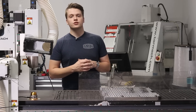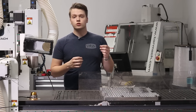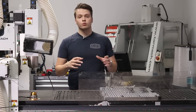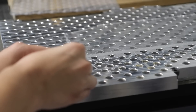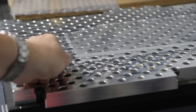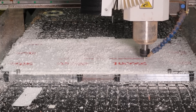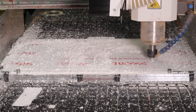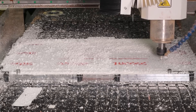It's taken me a little while to get used to this vacuum table, but there are a few tips and tricks that will really help you succeed. The first one is always use downcut tooling whenever possible. Lateral forces aren't an issue, but vertical forces are — if you push a part from the side it's very hard to move, but barely lifting a corner with your fingernail will break the vacuum immediately. Small tools also really help: a larger tool puts more cutting forces at the edge of that flute, while a smaller tool will have less cutting force to pull the part up and break your vacuum seal.